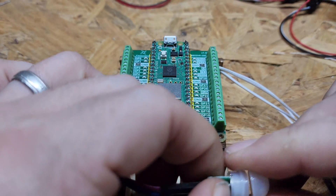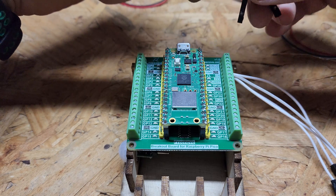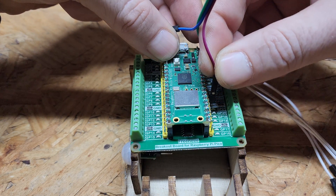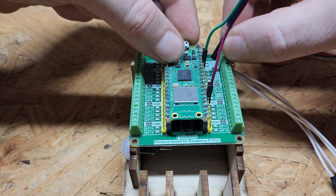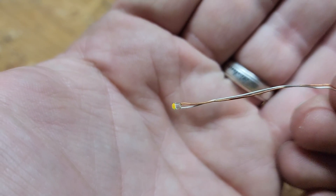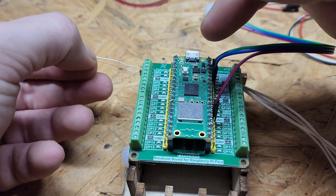This is a passive infrared sensor I picked up on Amazon for about $2 apiece in a pack of 10 — link in the description. I'm going to use a Raspberry Pi Pico W for this because I want the WiFi to replicate the smart sensor. I'll be setting this up to send MQTT messages for active and inactive alerts and other sensor readings, just like the Shelly. Connecting this sensor to any Raspberry Pi or other microcontroller is straightforward. It requires anywhere from 2.7 to 12 volts DC and acts like a switch, passing its input voltage to the output pin when motion is detected. I'm using the 3.3 volt pin from the Pico and running the signal wire back to GPIO pin 21. I'm going to use this micro LED to show when the sensor has detected motion, connected to GPIO pin 2, in case I want to use the UART on pins 0 and 1 later.